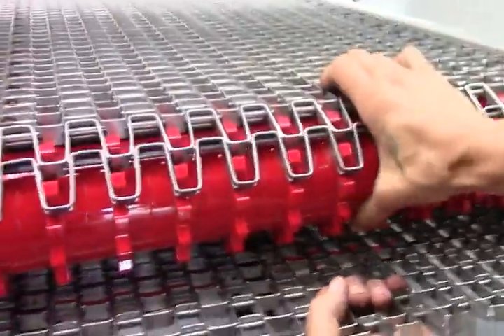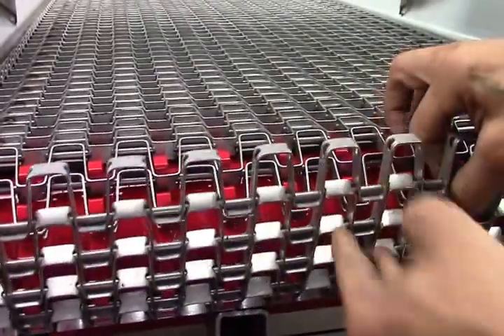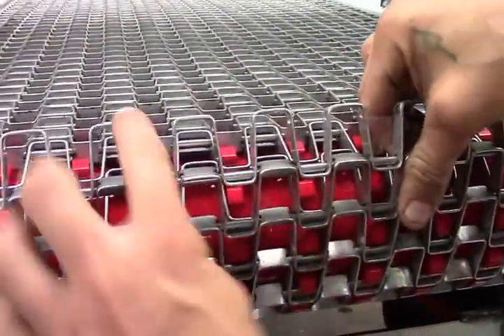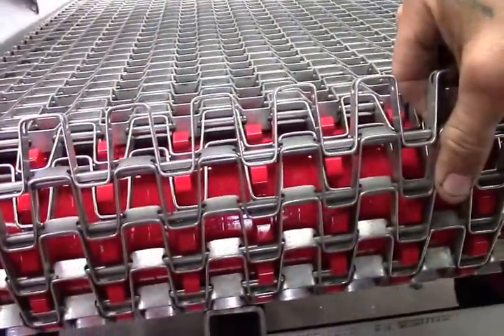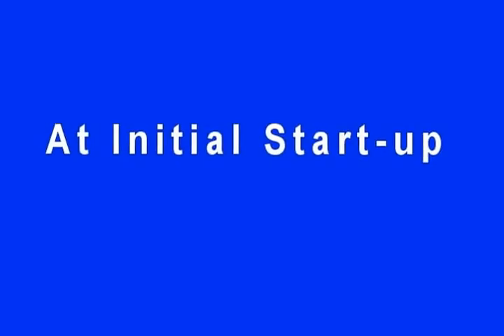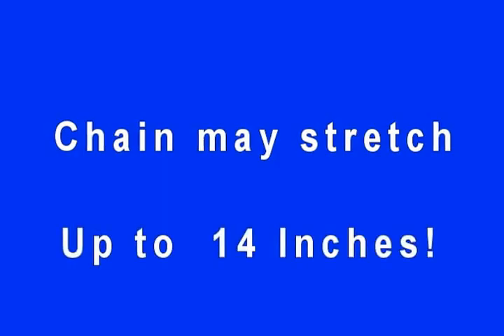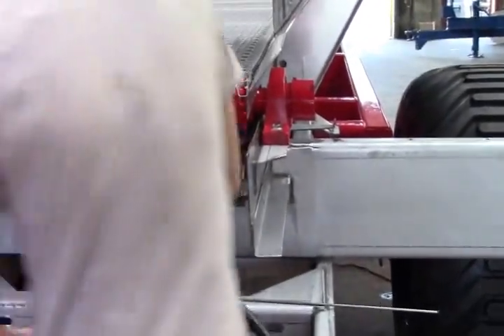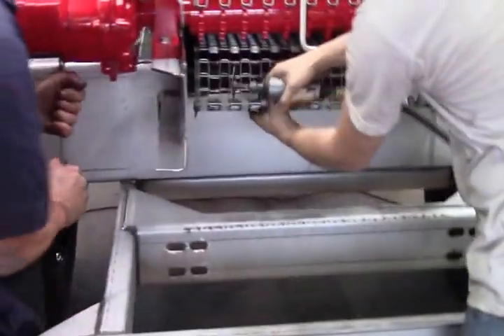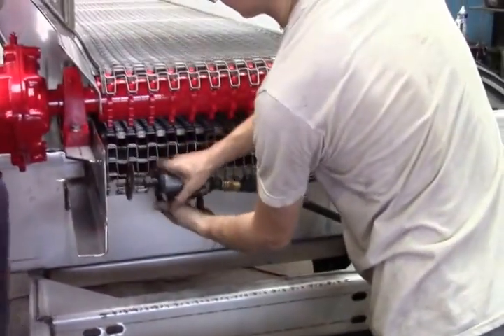Pull the chain as tight as you can. You want to remove as much slack as possible. That will allow you to pull one or actually two more inches of chain out of the bed chain. Conveyor chain will stretch during the first few loads of product. The conveyor can have slack under the hopper but must not drag across the cross-members. Now the chain is pulled tight — mark the excess, cut the pin, and remove the excess links.